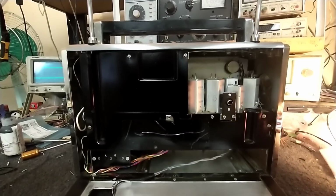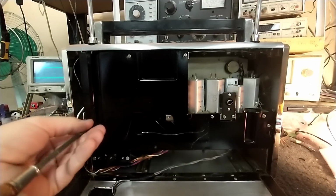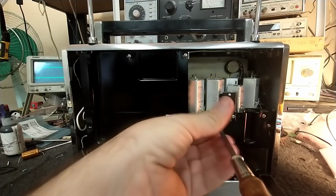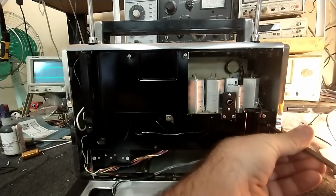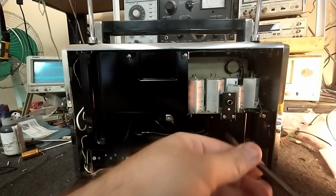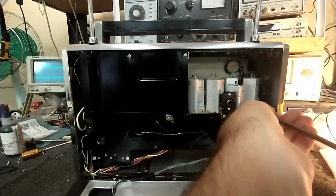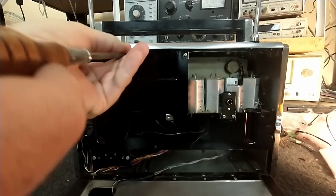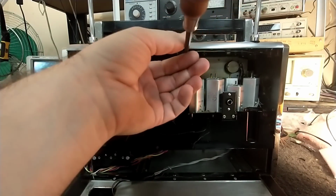Just get the camera mounted a little bit better here. Because I know everyone kind of likes the suspense of taking these apart. Anyway, the problem of it is that it looks like it's had some kind of an adapter attached to it, which isn't a very robust adapter. It's only rated for about 300 milliamps max, which in theory could work with this. I can't really see this drawing a third of an amp unless it were at maximum volume, but who knows. At worst, we can always supply it with external power and see if that's it too.